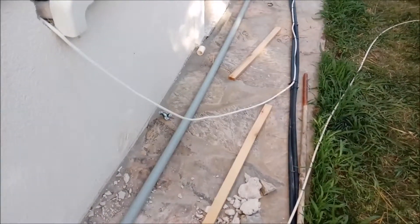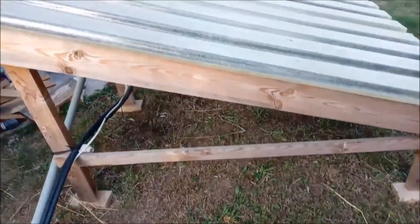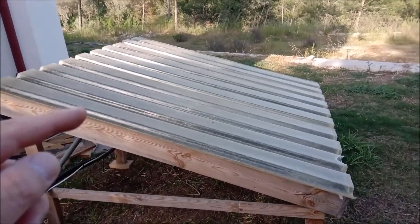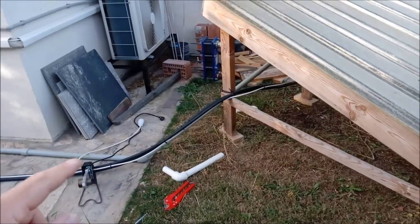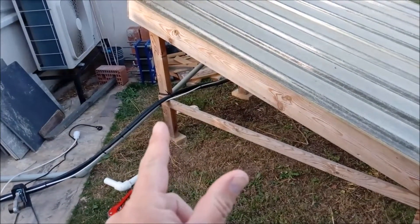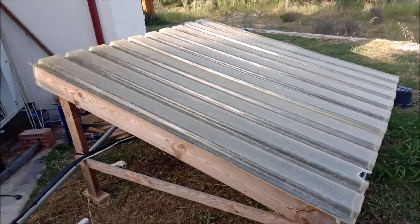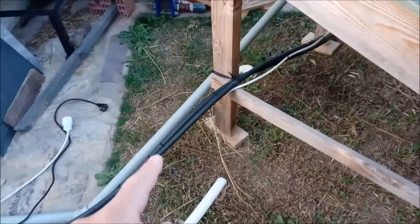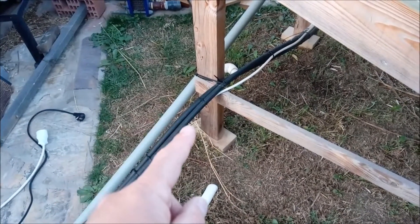The pipe I pointed to in the pump room — it's this pipe here. I've just put these little 45-degree fittings on here and here onto this gray pipe, and then that gray pipe — it's 40 millimeter — comes up here as you saw before, and that's the pool heater. As I explained earlier, I've got one coil in there of 100 meters of the 20 millimeter irrigation pipe. What I'm going to do tomorrow is get another 100 meter coil and lay it on top. The gray pipe will have a Y connection that'll branch off and feed both pipes — the two 100 meter irrigation pipes — and then the outlets will both be return.